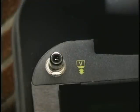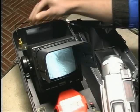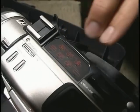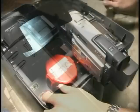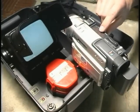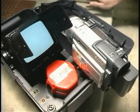The video input-output jack is a dual-purpose connector. When the camera reel's interconnect cord is plugged in, the jack provides a video output signal to an external video device like a camcorder. When the interconnect cord is unplugged, the jack becomes a video input for an external video source, so you can play back tapes on its monitor.